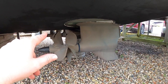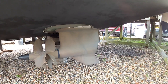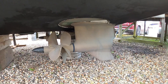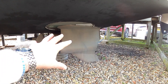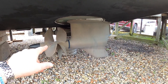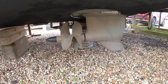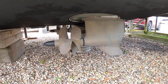You can only have IPS in twins, but the big advantage is the manoeuvrability because these are computer controlled — they swivel — and that means you can have a joystick. Push the joystick to the side and it can swivel the two pods independently of each other, controlling the thrust and making the boat do exactly what you want. They're also better from a manoeuvrability point of view than outdrives because the props are further forward on the boat, giving a bit more leverage. The forward-facing props operate in completely clean water since the boat is travelling in that direction, so they're reckoned to be the most efficient.